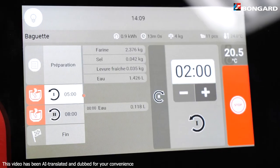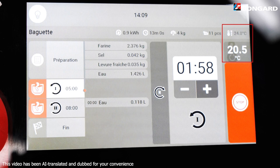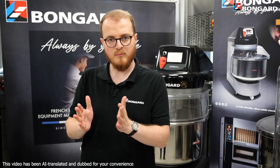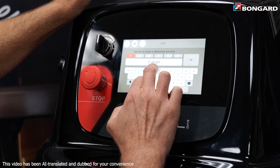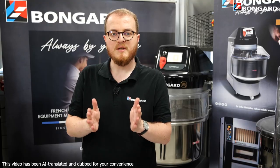The temperature of the dough can be measured by the infrared sensor built into the mixer and displayed directly on the control unit. If the specified temperature is reached, the mixer can either carry on but emit a warning, or stop immediately. Numerous operating details such as this one can be adjusted to adapt the mixer to different baker and pastry chef profiles.